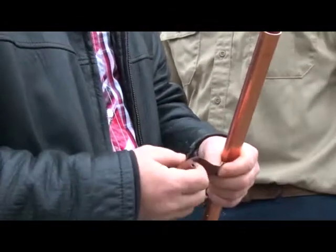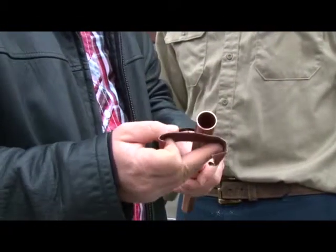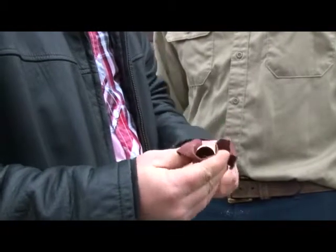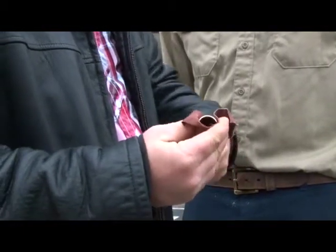Another very good practice is once you get it cut with the tubing cutters, use a reamer. Use the reamer to actually go inside the copper and get the burr. Turn it upside down so the debris actually falls out of the copper to keep the contaminants to a minimum. Once you have it reamed out, cut smooth and reamed out, use some sandpaper. Go around the outside. This will clean the copper and give a good, tight joint when it's brazed.